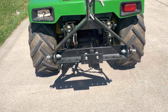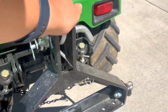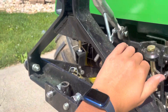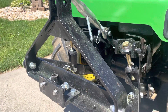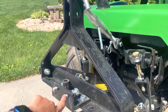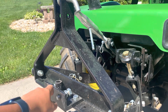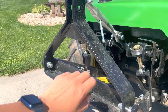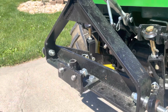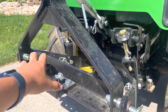That's our rug manufacturing 3-point Category 0 hitch. It's been on there a while — nothing much changed. I'll get a lot of questions about the A-frame. You can find it on eBay — I believe Rug sells that too. I also know Fulton Over Salvage in middle Pennsylvania sells them as well. They're all the same, but really handy if you want to run a sleeve hitch attachment and you don't have a three-point.